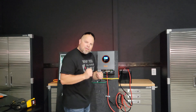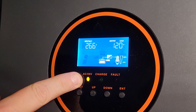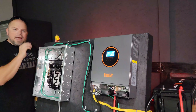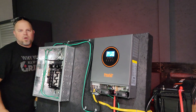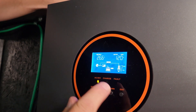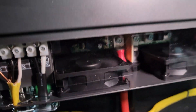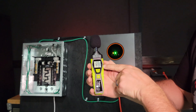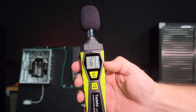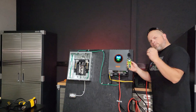Let's take a closer look at the display when we only had the battery hooked up. The yellow light is still flashing and this section of the display isn't active. Now I'm going to plug this into a 20 amp wall outlet. Once plugged in, we have a green light flashing because we're charging the battery, the orange light is now solid, and the fans have kicked on. Up close at about one foot away we're getting 52 to 56 dB.